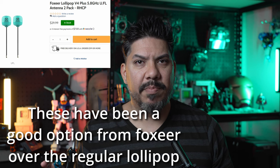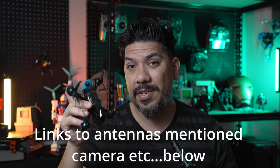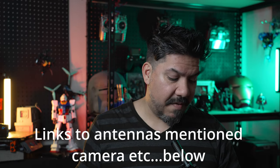I had noticed that Joe Mama's footage at the night spot always seemed a little bit clearer than mine. Just keep that in mind. I usually feel like the Lollipop series is perfectly good for analog, but spend a little bit extra if you're running HDZero because it doesn't have perfect penetration. You are going to get some breakup, but by upgrading your antenna, that breakup is a lot less, I noticed.